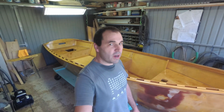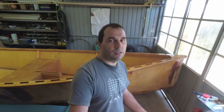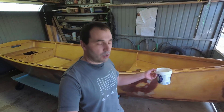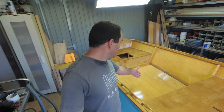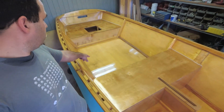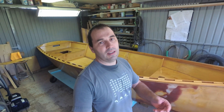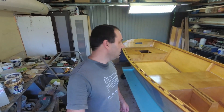Just to give you an idea - I used 0.9 liters on the other two coats combined, but on this coat I used 0.8 liters in just one coat. Way too much varnish. I've got puddles of varnish by the fillets, and when I tried to compensate by doing less on other bits it still doesn't look good - I can still see all the brush strokes. The only way I found to get a proper smooth finish was spreading the varnish as much as possible so I end up with a very thin coat. I'm going to sand that tomorrow and apply a very thin coat.